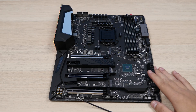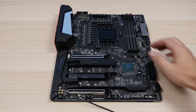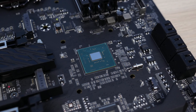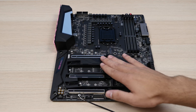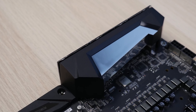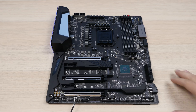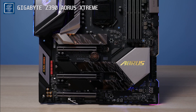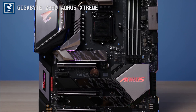Let's take a look at the motherboard itself before getting the actual mono block installed. As you can see it's pretty much a naked Z390 Aorus Extreme that's missing the VRM and the PCH heatsink. There have also been some slight physical changes mainly to the IO cover just here, and also these sections that extend from the integrated audio cover. These are mainly just physical aspect changes from the normal Z390 Aorus Extreme just to make this version of the board fit in better once you have the mono block installed. Everything else on the PCB and the VRM is pretty much the same.